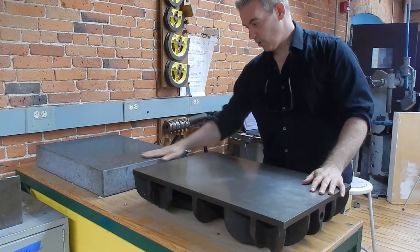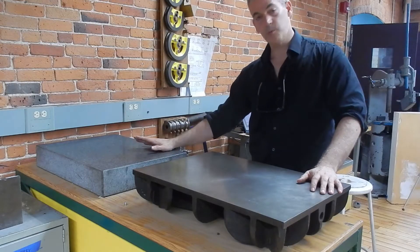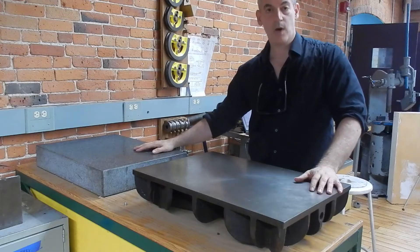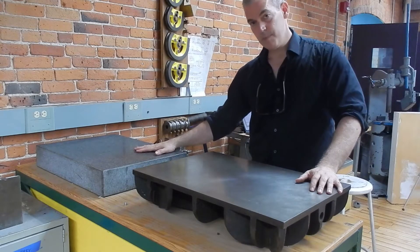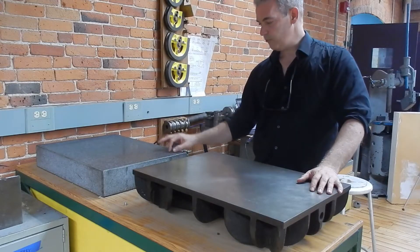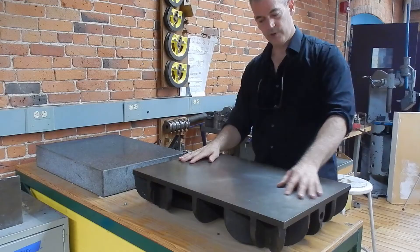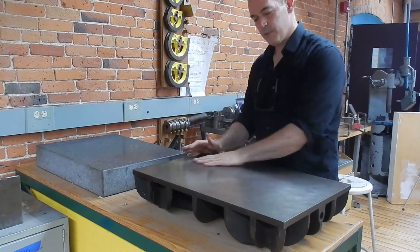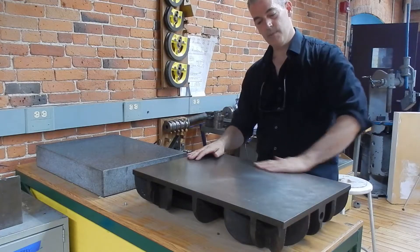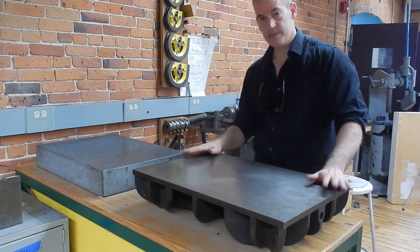The granite ones are also finished by hand. The reason we have two surfaces is the granite ones are a little more common today because they require a little bit less care to make. Also, they will age a little bit better in a high-use environment because when you damage them, they spall — they chip — whereas the iron ones can develop a burr which gets in the way of their working. So the iron surface plates require a little bit more care over time and a little bit of maintenance to keep them in perfect shape.